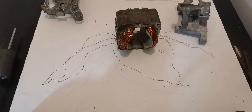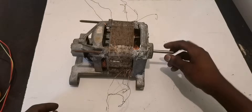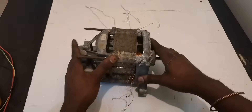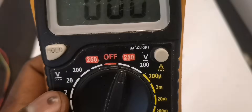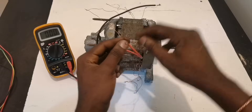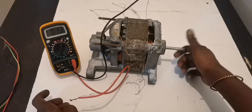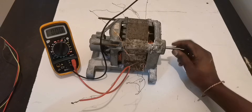Let's put this side together. I'm going to take a few minutes to push the rotor in the middle, then we'll continue from there. Now it's all done and together. You can spin it nicely. So back to explaining: all these are connected in series. Let's put the multimeter here on 250 volts AC. After connecting in series, we have this wire as output and this wire as output.